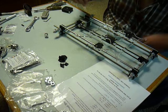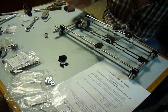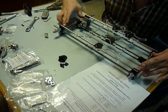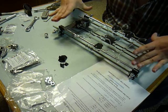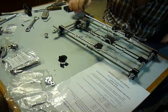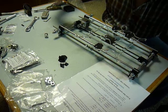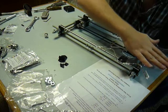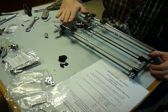And then you'll realize: holy crap, they don't fit. What's going on? Do I have to drill more holes? No. This might be obvious, this might not be — loosen your nuts on the inside, all eight of them, and then bring the whole thing in, make it narrower, so that it lines up with these. Then you can tighten your nuts, at least in this direction. Tighten them once the carriage is at its extreme in both directions.